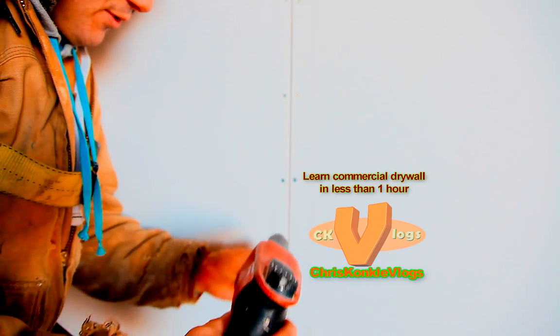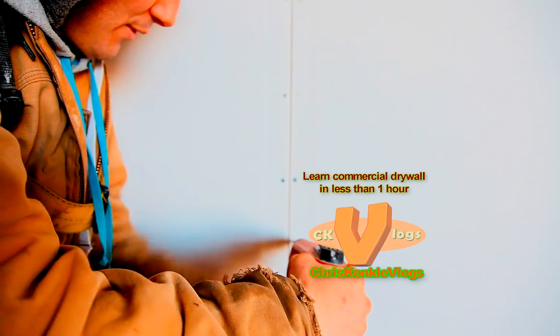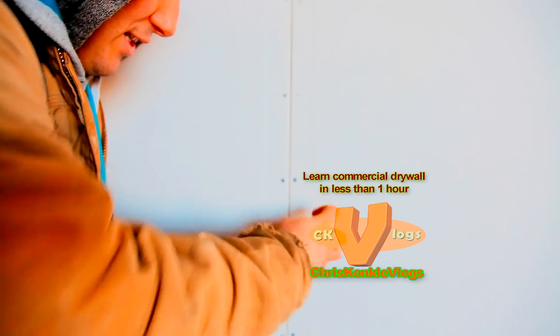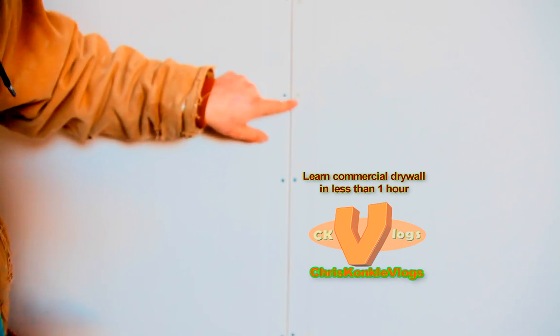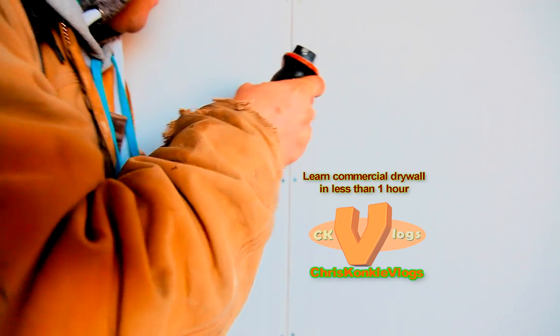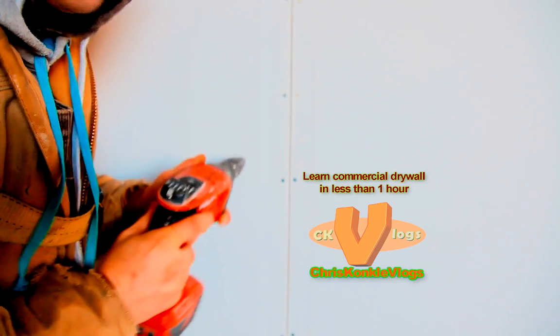You can see when I'm screwing in the soft side, I am screwing on a slight angle, and that is so that just before I'm about to hit the paper, I can snap it over, and that'll lock the sheet in tight and the stud in nice and square. Also, you can see the depth. I was a little farther out that time, so all I did was simply go over it again. You hear that sound? That's just fixing your depth, making sure it's in properly.